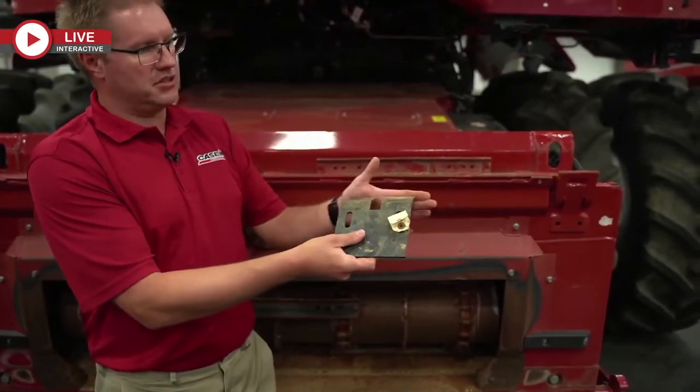When it comes to the hydraulic oil filters on the combine, I really recommend you just change them once a year. There are three oil filters: the hydraulic return filter, the control pressure charge filter — very important — and up above that is the lube filter, a little bit harder to see. Definitely recommend changing them every year; it's cheap maintenance and keeps the hydraulic system running a little cooler.